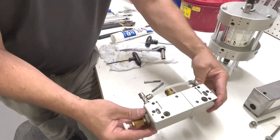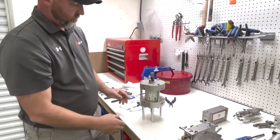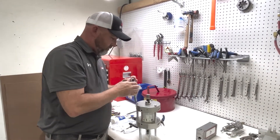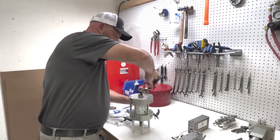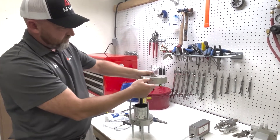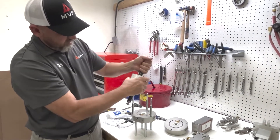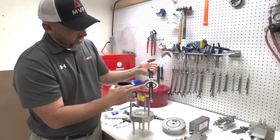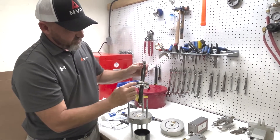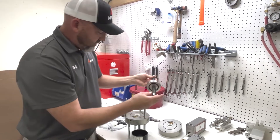We want to hook our polyline back up. At this point, after all those are replaced and everything's tightened down, we can move to the main part of the top. We can pull our top cap off and place it to the side, pull our piston out, pull our cylinder, and we want to inspect the shafts and inspect the cylinder — make sure there's no gouges or nicks out of it. At this point, if everything looks good, we can replace both o-rings on top and bottom and then the one in the center. We will lube this up really good before we put it back in.